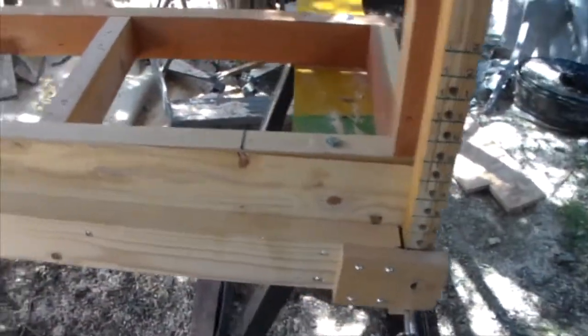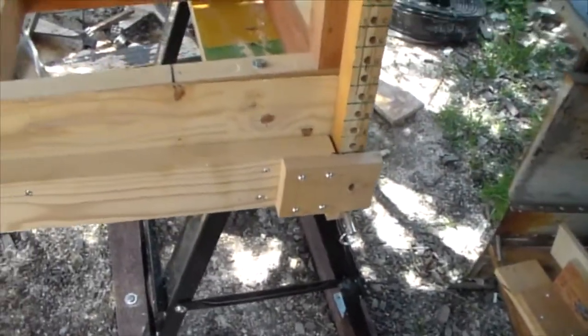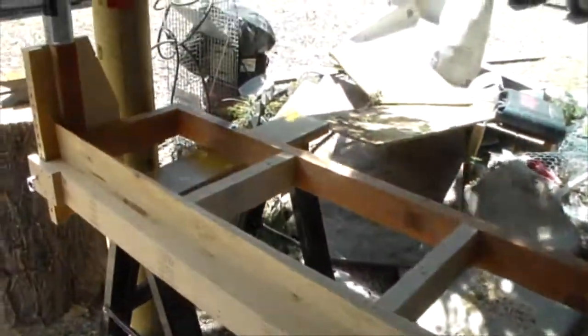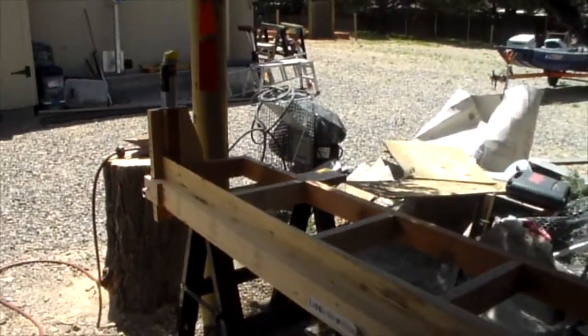So now let's work on this saw guide, getting the plexiglass in here to keep this from bowing and wobbling here, and probably some iron along there too to keep it stiff. And also, remember them sawhorses, I made sure all the bolts are tight, lock washered them, put some Loctite on them, so they're as firm as can be, and I think it's going to help cut quality a lot. So let's take that guide out and get the work done on that next.